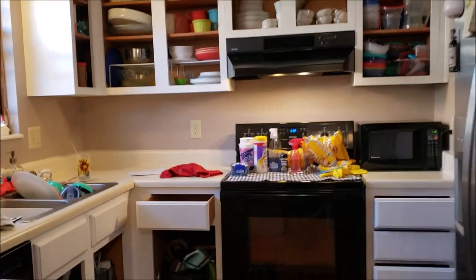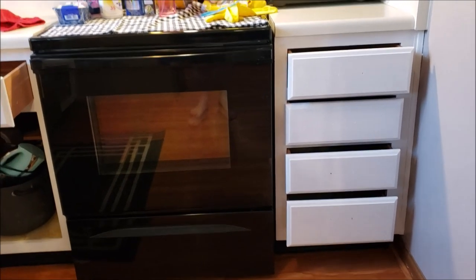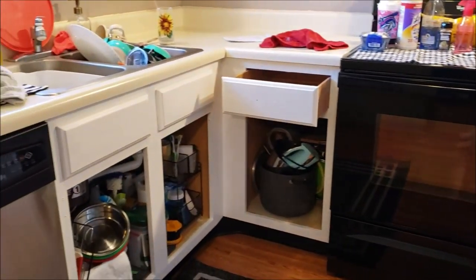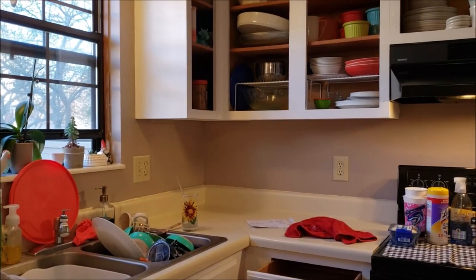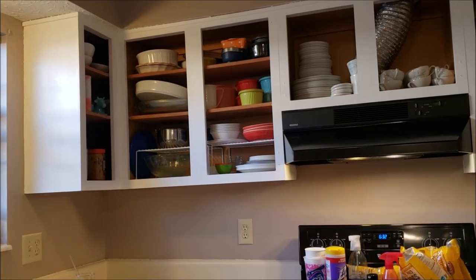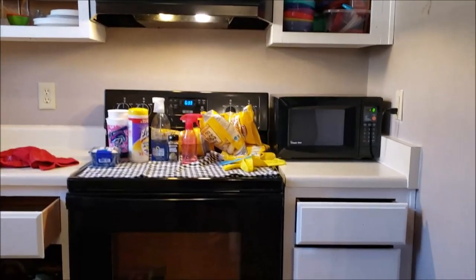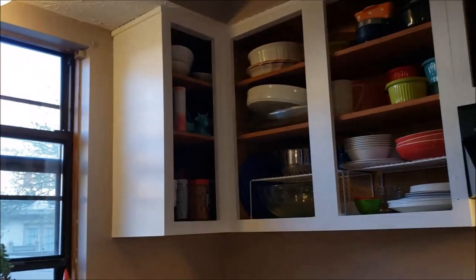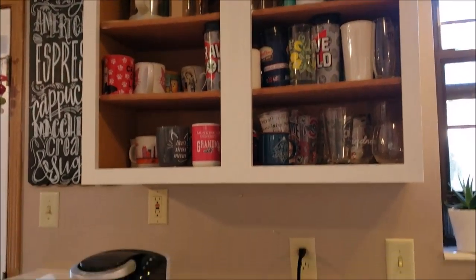I'm loving the white cabinets and I'm so glad I made this decision. The only thing I would have done differently is bought primer upfront. There was a question of whether I needed primer going from light oak to white — and I'm here to tell you, yes you do. This paint has to cure for 24 to 48 hours at least before I put the drawer pulls on and hang the doors. It's going to be a slow process but when it's done I'm going to be happy.